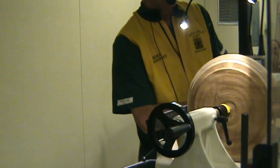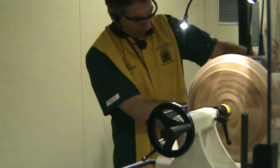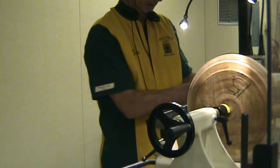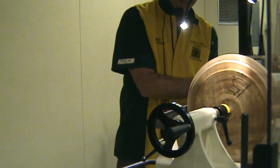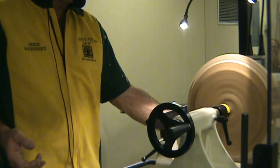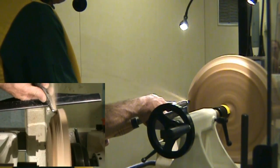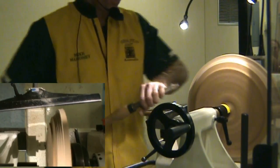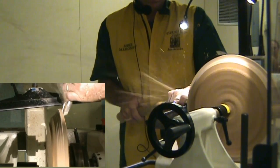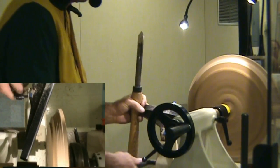It's on its highest RPM level, so the belt pulleys just don't give me as much torque as I'd like. I put it down to the lower speed to get more surface area but less RPM, which should be okay for this item. Now it doesn't spin nearly as fast, but I should get a lot more torque. The belt pulley system means a lot to the strength of this lathe.